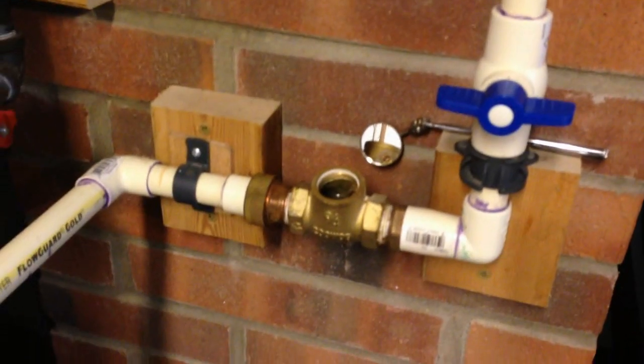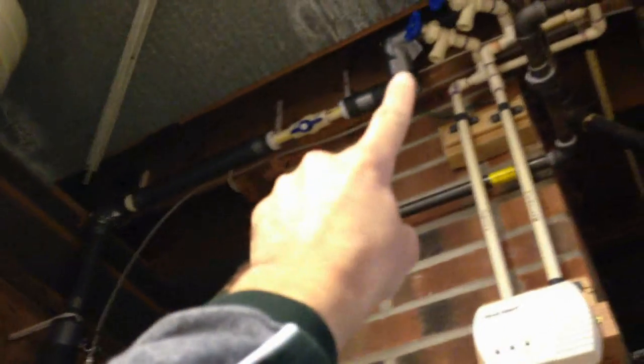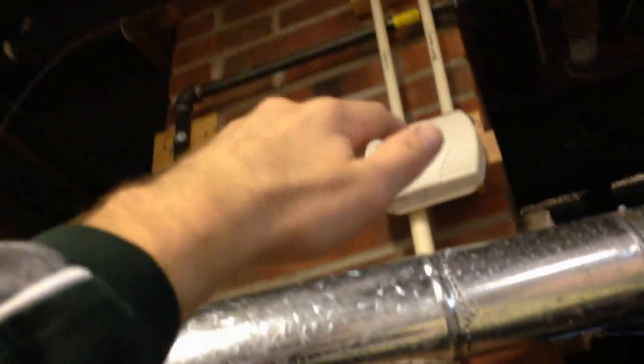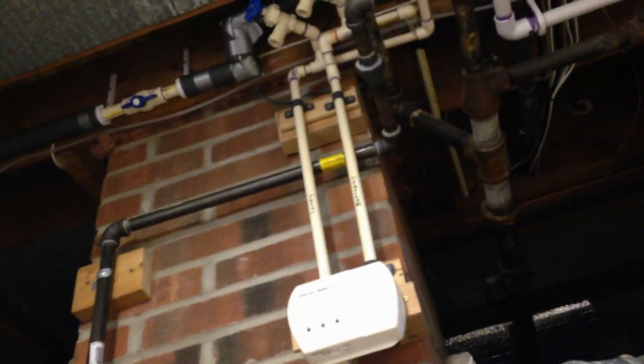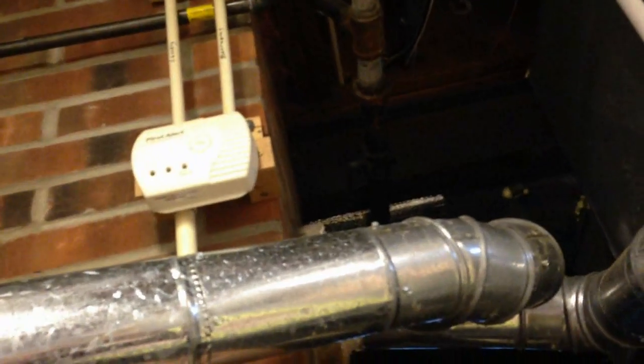In order for it to work properly, it needs to be insulated, and then it has to cool down. The part going up is insulated all the way to the other end of the house on both ends. Then it's not insulated when it gets to about 70% of the way back. That causes it to cool down as it's coming back, and then causes a natural recirculating motion, because the cold water falls and the hot water rises, which drives the circulation.